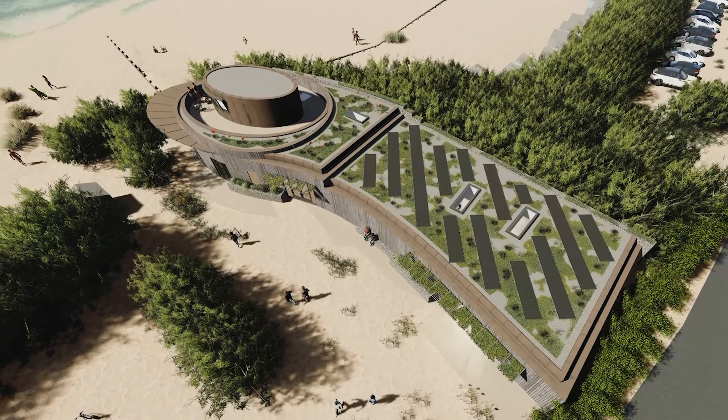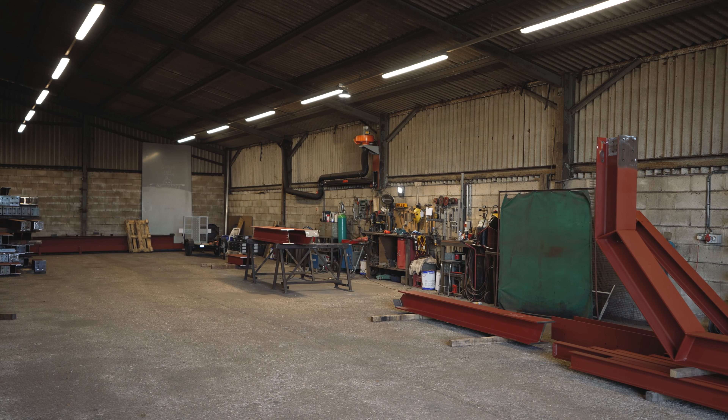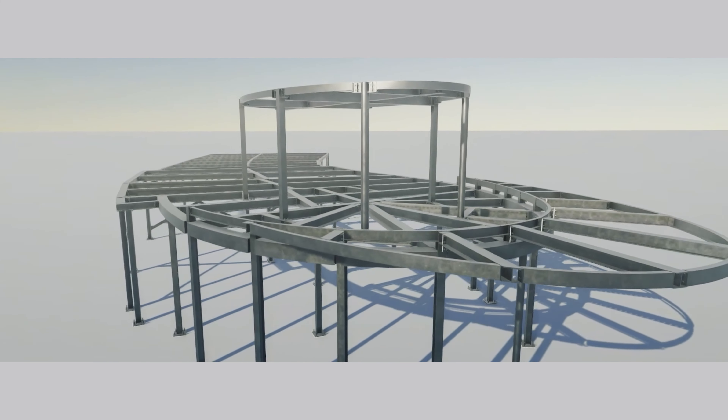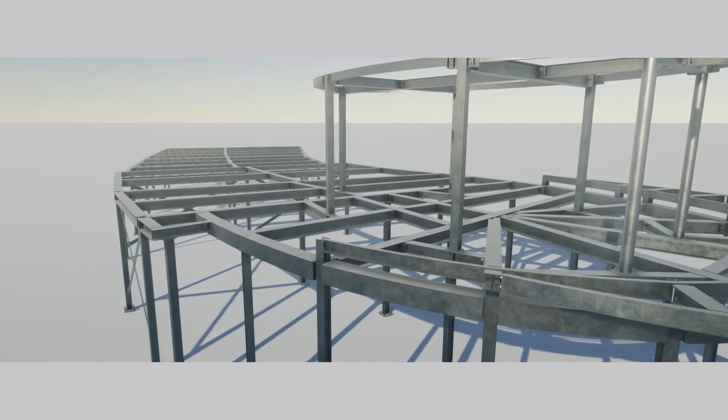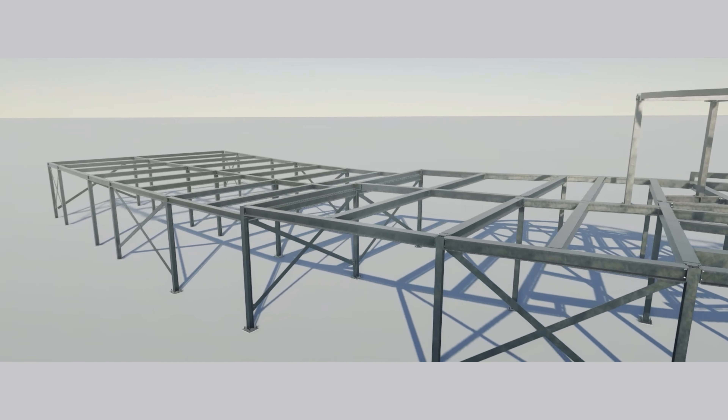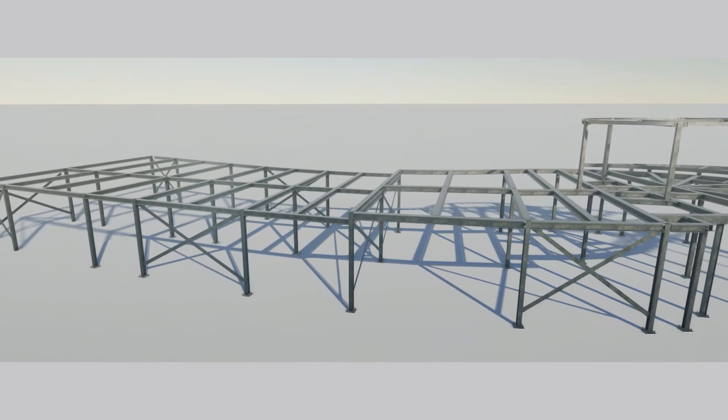SFABs will be presented with a set of architects drawings and structural engineers drawings. It's our job to pull the two together and try and come up with a design for a steel frame which would both be structurally sound and also taking the aesthetic of what the architect's trying to achieve.